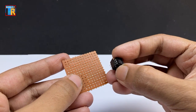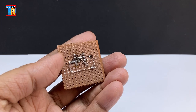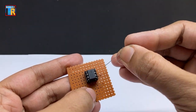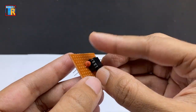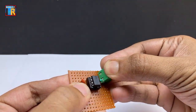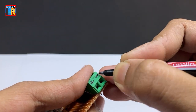I am placing all components on a breadboard. I am using an IC base — it is optional, you can use only the IC. One terminal block is for power input and the other for DC motor output; mark positive and negative on the terminal block.